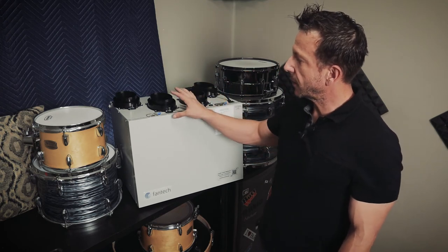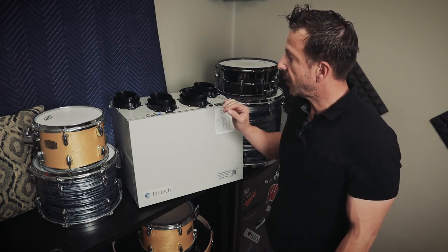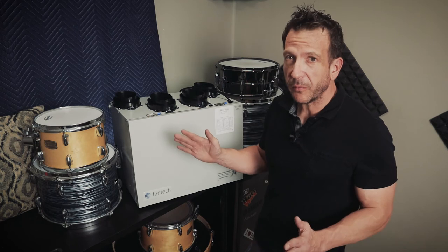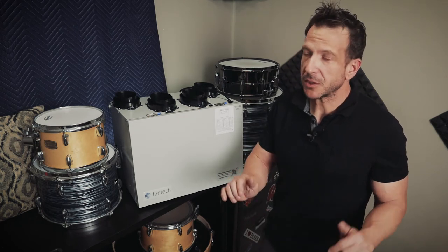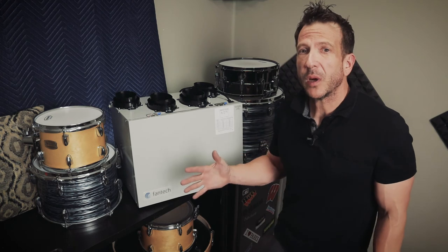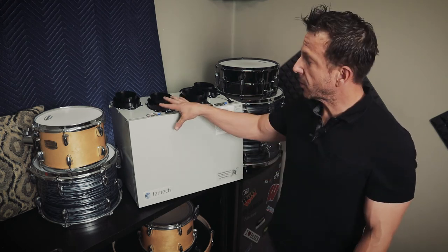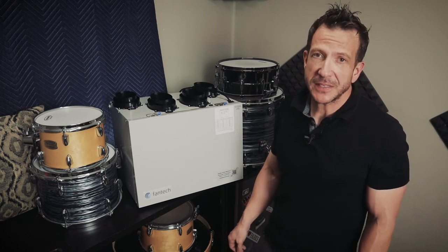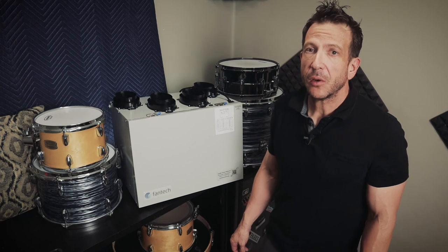So we still are going to be dealing with ductwork in this application, but we're talking about airflow quantities that are very low compared to what would be used if you're doing heating or air conditioning. So ductwork is quite small, penetrations are small, and we're going to be looking at some ways that we can help mitigate those ductwork paths as a path for sound, using something called a baffle box, or it's also called a sound trap.